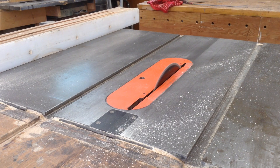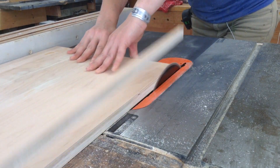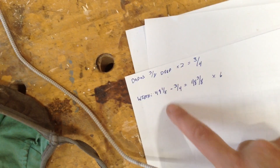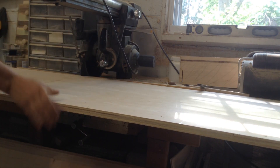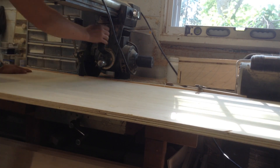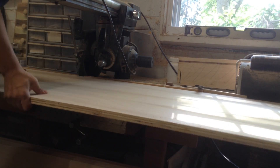Cutting the shelves is pretty easy — now that I have the backer in place, because that deducts thickness off your shelves, I can cut all of these. The two side cabinets are going to be the same depth and the back, thicker cabinets will be different. My dados were three-quarter inch thick, so I have to add three-quarter inch material to go into those dados. This took about 11 sheets of three-quarter inch plywood — it's a pretty big unit. The back cabinets are both 48 inches wide and 24 inches deep, which is why I made them in pieces — there's no way to transport that safely up the stairs.